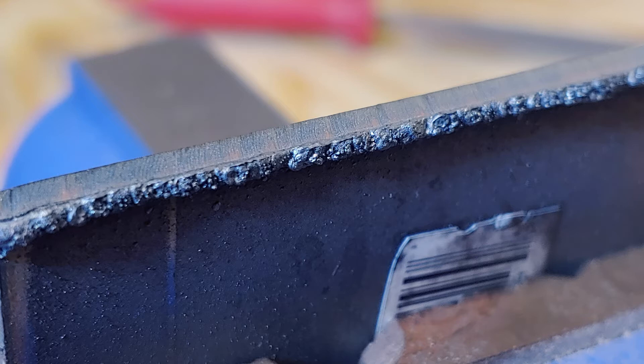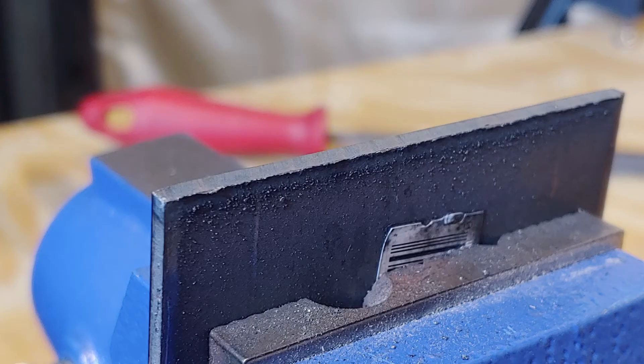As you can see, the cut is flawless. There is a little bit of slag or dross underneath the cut — that's to be expected. You're going to get that with any plasma cutter or oxy-acetylene torch. There are ways to minimize how much you produce, but it's always going to be there. It knocks right off with a chipping hammer or sander. And here's the cut after I knocked the dross off — it's a super clean cut, and even though I was moving slower than I really should have been, it was still tons faster than using an angle grinder.